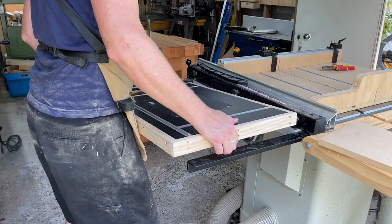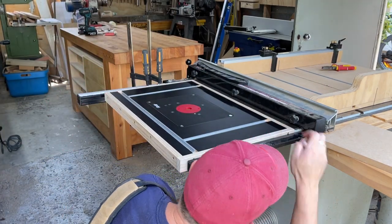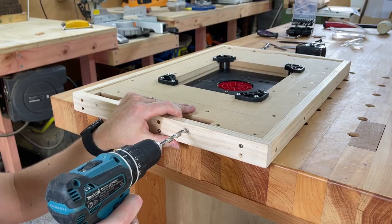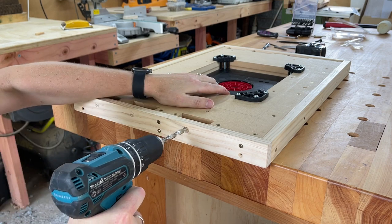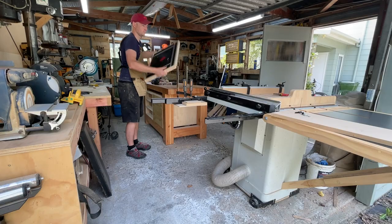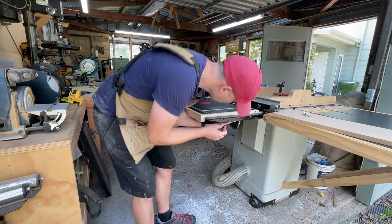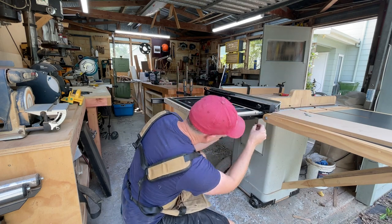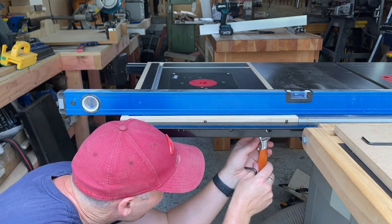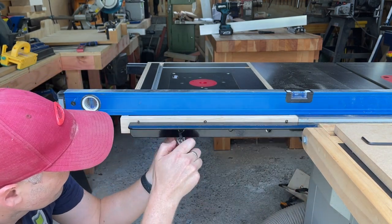Attaching the table to the saw should be as easy as measuring and drilling the holes for the bolts, checking for level, and then inserting and tightening the bolts. However, there are a few pitfalls to watch out for — like the holes on each rail looking like they're spaced the same on both sides but they're not, or said holes looking like they're level with each side but they're not. Or lastly, not using wide enough wood for the edging so your holes end up being very close to the edge of the wood.